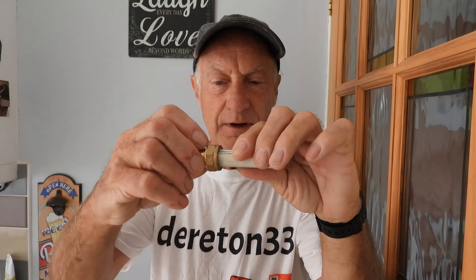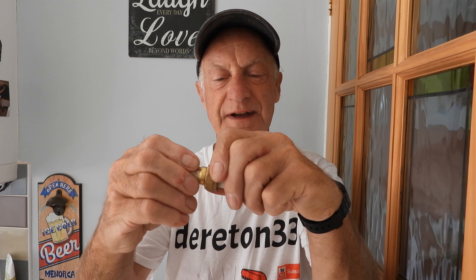Sometimes a pipe can be up against the wall and a bit awkward, but with this one you can at least ratchet it — so if you had a wall there you could just keep going; it will clean it. Once that's done, I'll still use a bit of paste around the front of it. Drop it down and then put the paste around the joint.